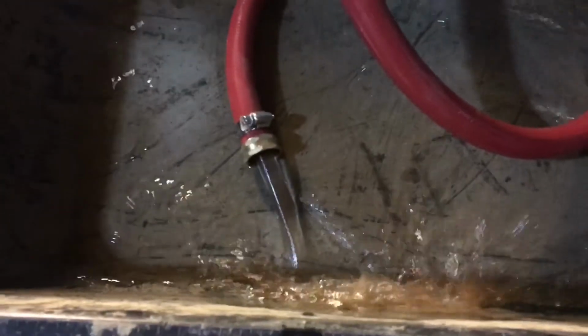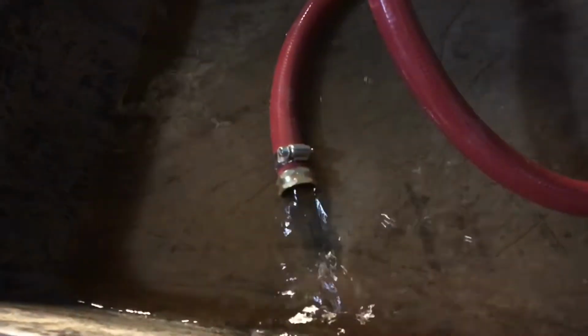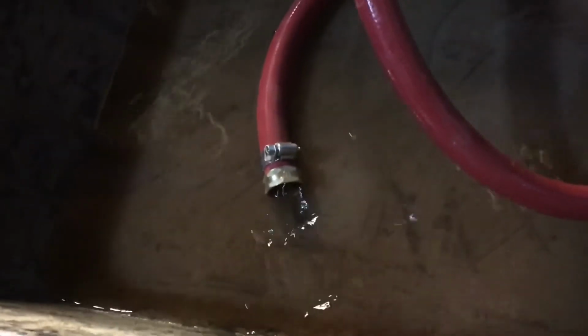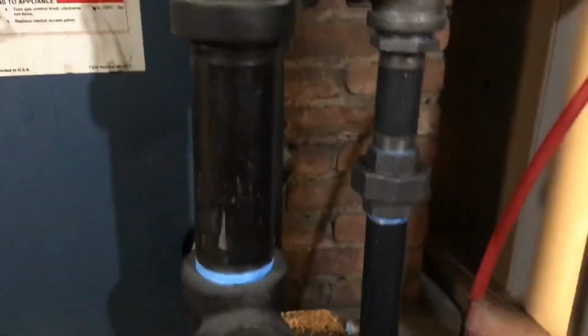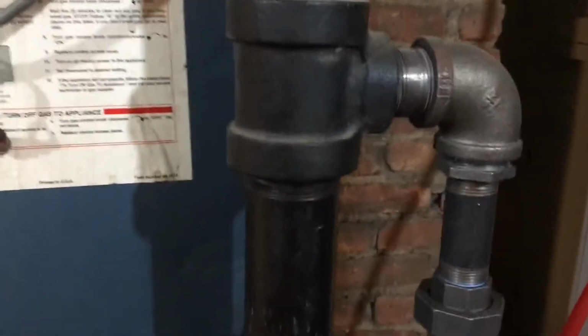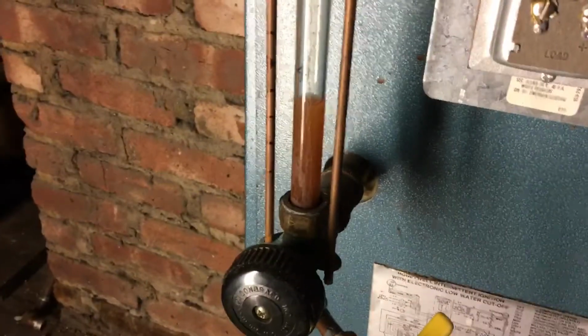There it goes. That's the water from the wet return, and it's also the new condensate water that's coming into it. And it's going to take the water level of the boiler to right about here, which is the level the Hartford Loop protects it at, I guess you could say. That's the level the Hartford Loop keeps the water at if there's a leak in the wet return. And you can see the water level has dropped to that level.